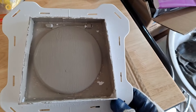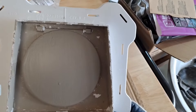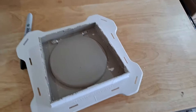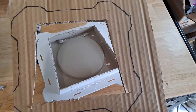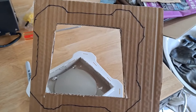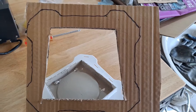The question is how to fix the position — which I'm going to do from inside the attic — to determine where this hole is going to be. To do that I've made a template. I'm a big believer in templates. I'm not going to carry this plastic thing up into the attic and try to hold it against the wall and guesstimate where the hole is going to be. So what I've done is cut a template from a piece of cardboard — you can see the outline of the flange, and I cut the hole in the middle. I've left about an eighth of an inch all around for clearance, which I'll seal up later. This cardboard template is going to let me mark the hole from inside the attic, and then I'll go outside and use this template again to cut the opening.